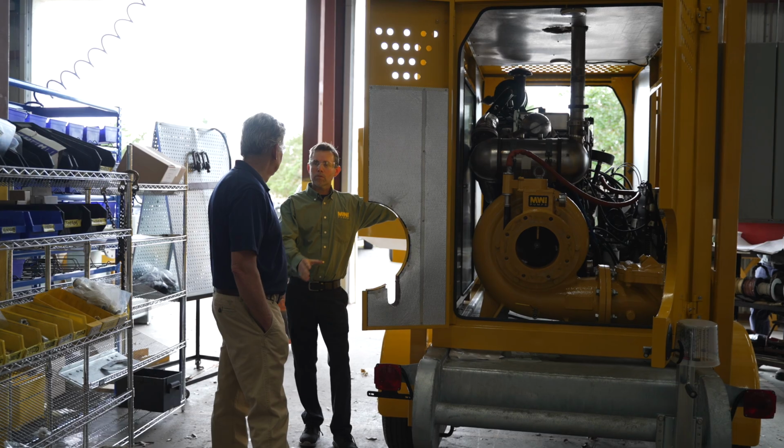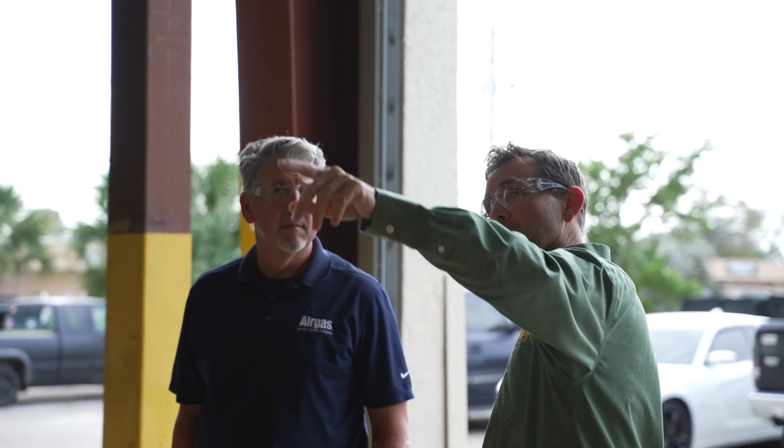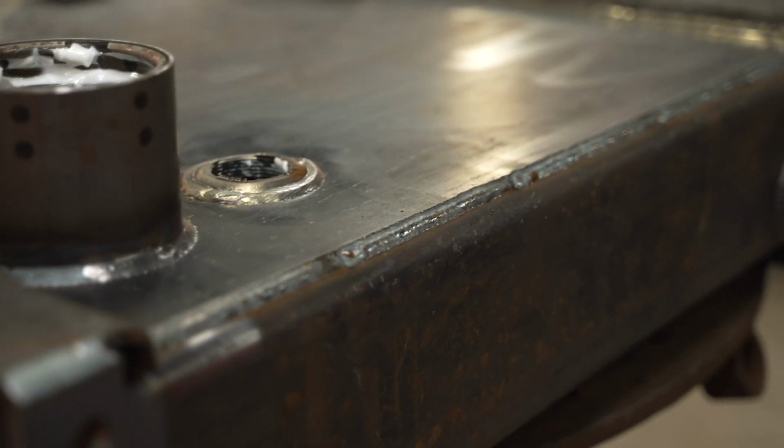Yeah, so I met Darren, and I asked if I could take a tour of his facility. I wanted to know a little bit more about the process. He spent about a day or so here looking at some of the welds we were doing, seeing how people were setting up their machines, and out of that, realized that even just basic setups on your voltages and the amps on the machines weren't being done correctly to be able to get the welds that we wanted.